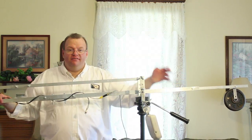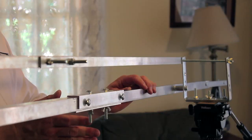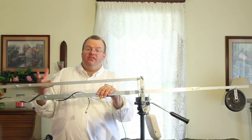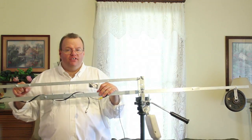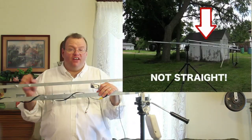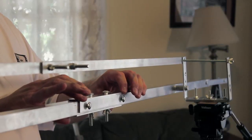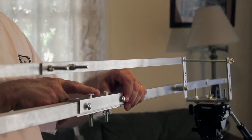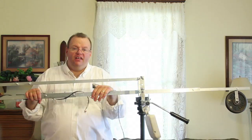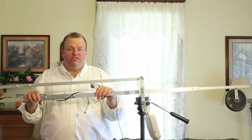In keeping with my desire to keep this portable, this big long tube had its own challenges — in order to keep it portable, I had to cut it in half. Now this created a joint, and as I talked about before, anytime you have a joint you're going to have play. So I placed another square tube inside of it that was a smaller diameter to keep things more rigid. But it actually was very crooked no matter how tight I made it. So I decided to add something on the outside: I took two pieces of angled aluminum and mounted them opposite each other at the joint. Not only is it now very, very straight, it is just as strong as if there was no joint there at all — basically erasing the possibility of play, and because of its strength, there is no twisting.